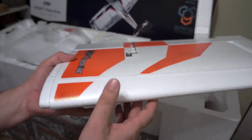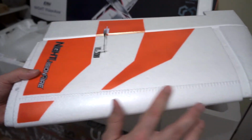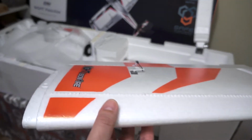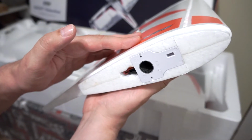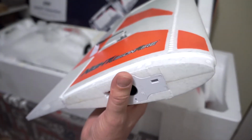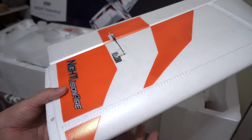On the wing, they are vortex activators, just turbulators. I think in English language it is the same, turbulators. This is nice for a bigger angle of attack, for lower stall speed, and stall with this turbulent airflow is not quick but slower. Yes, this is perfect for better flying on lower speed airplanes, of course.